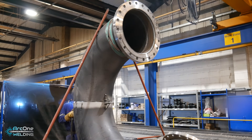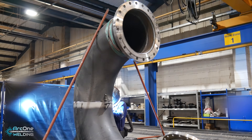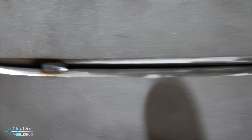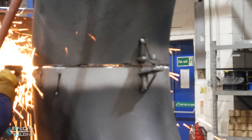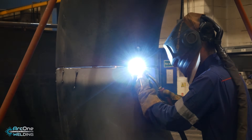Horizontally I leveled off the face of the flange and the two bolt holes, and then I lifted it up vertically to level off the second orientation of the flange - not to the other flange that's not in shot. I've now checked the overall measurement and it's bang on. Happy days, now I can weld it up. I'll link some other videos that explain how I do a positional weld better. This video was more about bringing you along with something I've never done before - these big old pipes - so I thought it'd be interesting for you lot to see.